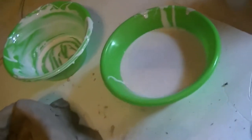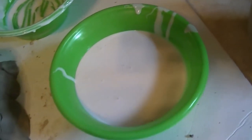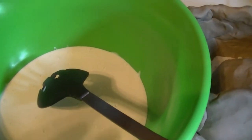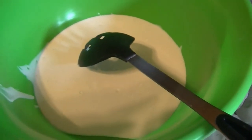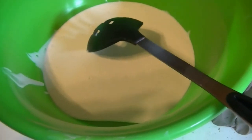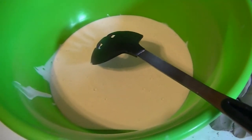Here are two different bowls of silicone. I've emptied this one into the main mixing container. This one I'm preparing to pour. Now, when I mix these two together, I will weigh the combined weight, by weight, not by volume, of that silicone, less the measurement I already took of the bowl. Then I will divide that by 10 and add the catalyst. Be right back.